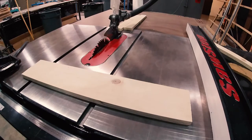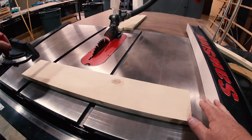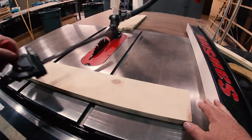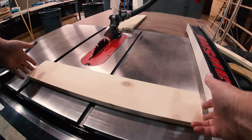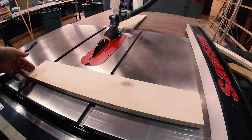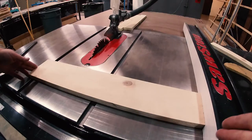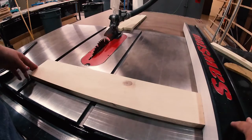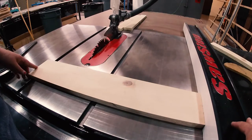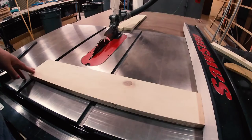The general rule on when it's safe to use the ripping fence versus the miter gauge is how your wood is oriented and how it is in relationship to the fence. The ripping fence is designed for ripping, which is cutting with the grain of wood. Most of our pine has wood grain that goes in the length of the long strips of wood.